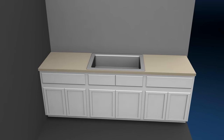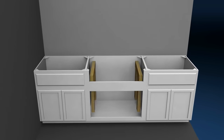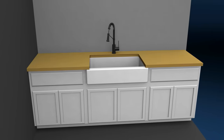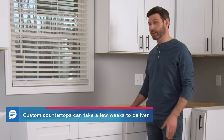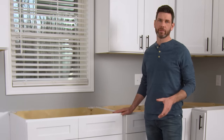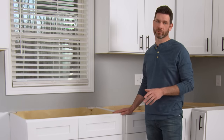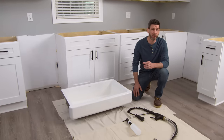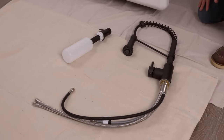The plan for this project is to remove the old sink and countertop, prep the cabinet, install the new sink, and finish by installing new counters and faucet. If your new top is stone, a countertop installer is going to measure your cabinets and sink to create a custom top. Some installers will require the farmhouse sink to be installed before measuring. Have your faucet, soap dispenser, or any other accessories that need a hole drilled on-site ready. It's also a good idea to ask the installer if there's anything you need to do to prepare.